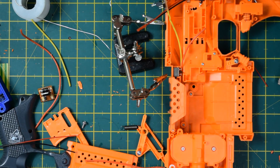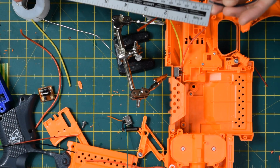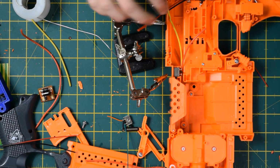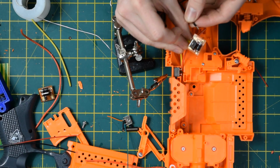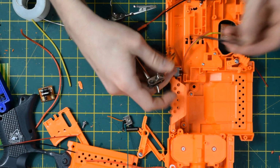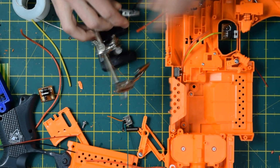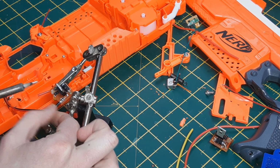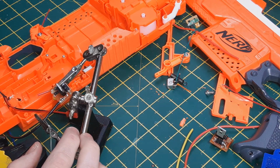So this is a short black wire. It's going to run out the back here, enter the negative terminal of the XT60 connector. And this is just a case of quickly pulling off approximately 5mm of heat shrink tubing there. So black wire is black here, goes there, and if we bring the two wires together, there you are, nice and secure.